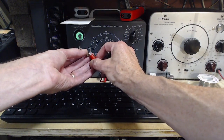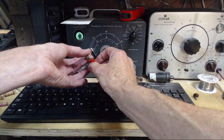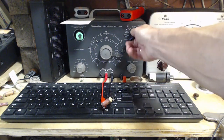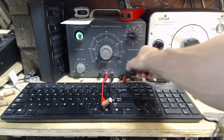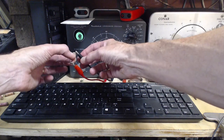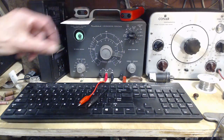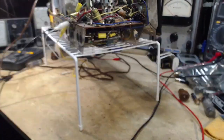Now this is the guy. No, he hasn't barfed out at all, I don't think. Let's see. 50 volts. Looks good. 150. Well, 200, I bet it doesn't open on 200. Well, it still does. Oh yeah. So these two capacitors, not as bad as the others, and that's probably why the resistor is not all fried up underneath like it was above. Probably. If you're going to be scientific about everything, probably is as good as it gets.